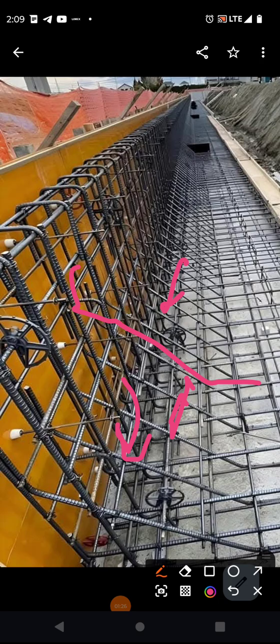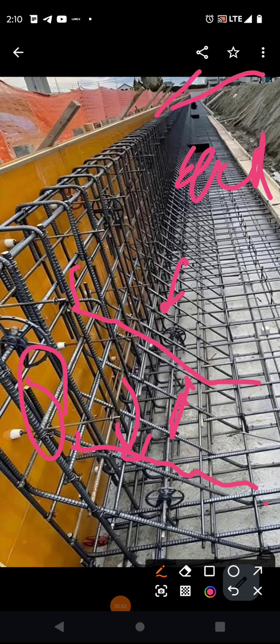And the rebar is going, so you see it at the bottom on the floor, if you will, coming up, and then wraps around the back or the front of the street side, if you will, the walking side, not the soil side. This is all the soil side over here. This will all be soil up to there approximately, depending on the surcharge, whether it's going to be level or go up higher, a little bit positive up. But that's not the only issue here.